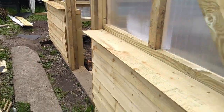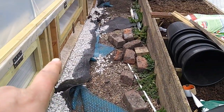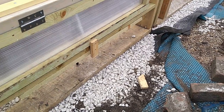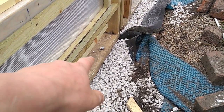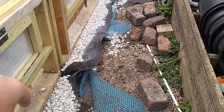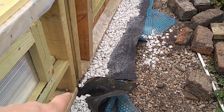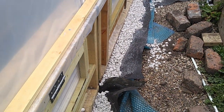effect. And that's going to be going along the bases, going that way. But because they're only 4 feet and these are about 5'6", the bays, the feather edge is probably going to drop around here, and so we'll have to carry on along there, and where the feather edge lands, that's where we put our back support that we can screw to, our back upright that we can screw to all the way along.